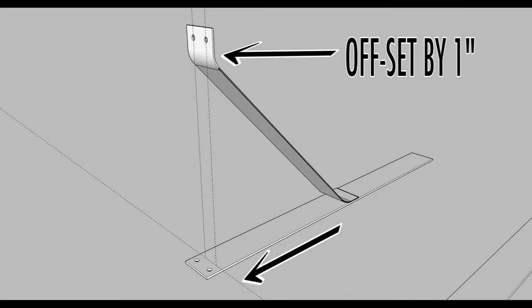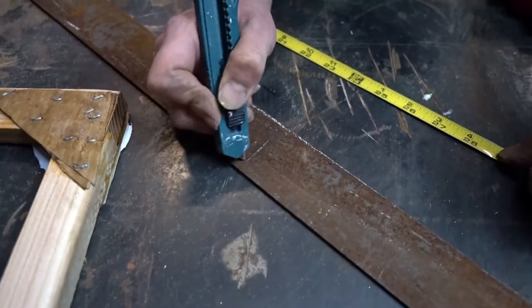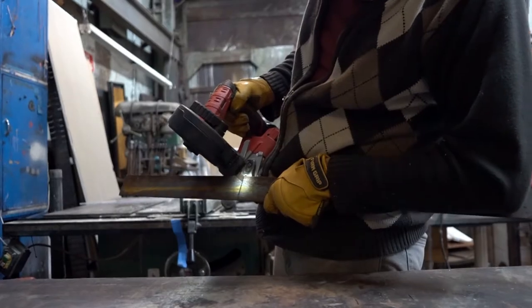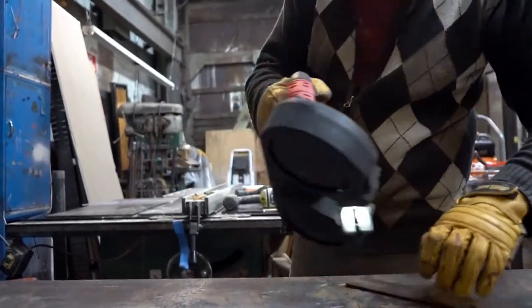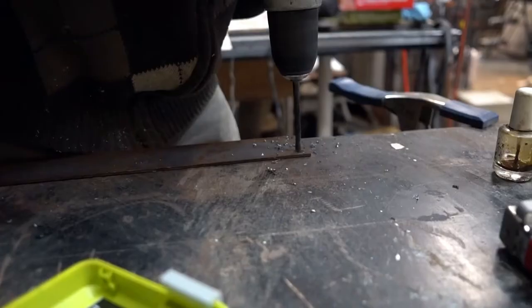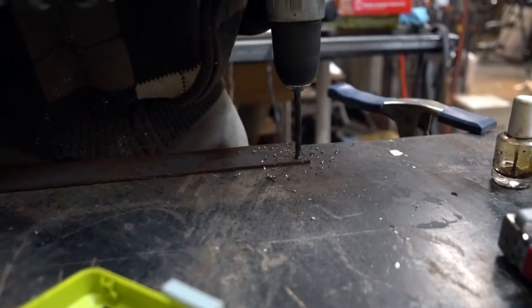However, if you're following the design principles in the primary video, you might realize that these brackets are actually only useful for when your barrier goes right down to the counter. If you're going to do an elevated barrier, say 13 inches off the counter, and you need braces, you probably want to switch over to the steel track section.